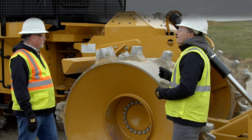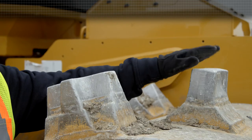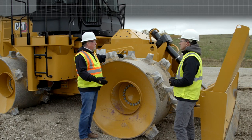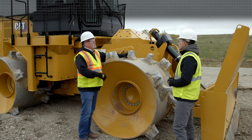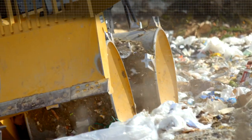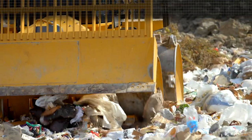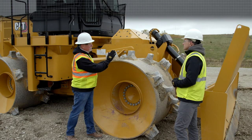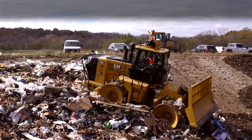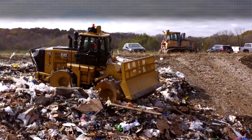But why would a customer choose a paddle tip wheel or the combo wheel? The paddle tip is a straight tip — it's aggressive, it's narrow. It's got an I-beam shape, so material won't stick to it like it would a smooth surface. Vibration and centrifugal force will kick off the clay, mud, and sticky material, and it's got great traction. You want to use this when you're going in a straight line. It doesn't have a big side slope stability profile, where our plus tip does. So up and down hills, with a lot of moisture material, or when chopping is needed to open up bags, this is a lightweight, very high productive tip.